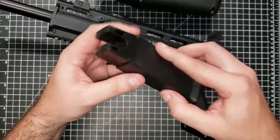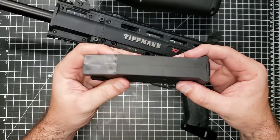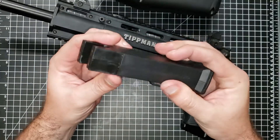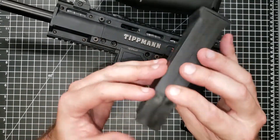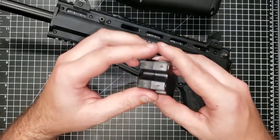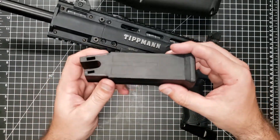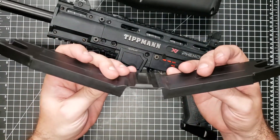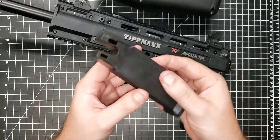Making thick parts out of plastic is not cheap. If they tried to make this solid, they'd have a bunch of manufacturing problems because thick plastic in injection molding wants to sink, warp, and distort. There are other ways to make hollow plastic parts, but those are more expensive per piece — blow molding is one example, that's how gasoline containers and milk jugs are made. But this is cool: everything you need built right in, and it's not meant to be a functional part so it didn't need any further detail.